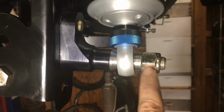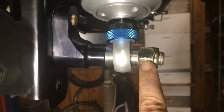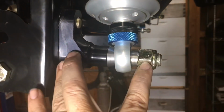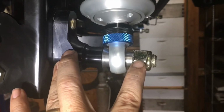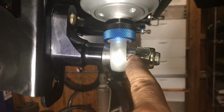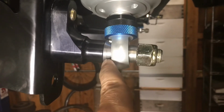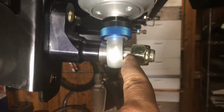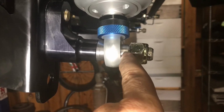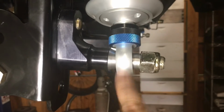And so, you know, the spec torque value for a grade 8 5/8 fine thread bolt is 180 foot-pounds. Knowing that these single shear setups are sensitive to the amount of crush you have as to the amount of strength you have in bending, I went with a conservative 100 foot-pounds. And before I even got there, I started flaring out this spacer. Luckily I have 2 extra ones because I've replaced these. Now obviously this chunky beast right here didn't flare, so it's fine. So I'm going to go back and try it again, maybe with 75 foot-pounds, and hopefully we get there without crushing another one, because I've only got one extra after this. Anyways, I'm going to get these torqued down and call it a day.